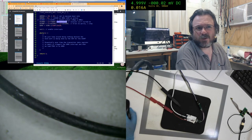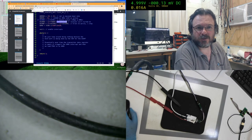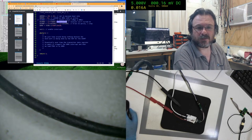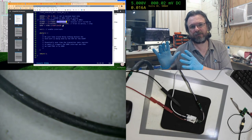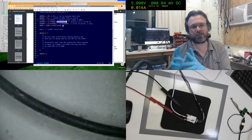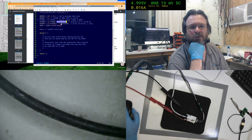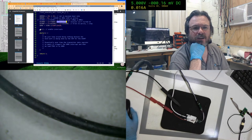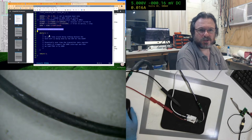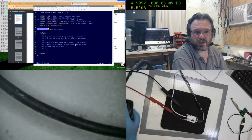Not likely, Tony, because like I said, we've tested these same settings with the other firmware and it comes out fine. It's more like it's pumping the register or not putting the register out correctly. I don't know. Yeah, but with the AVRs, you don't need to do that until you get ready to. You can preset everything and then run, and then activate your interrupts and away you go.